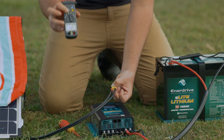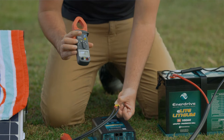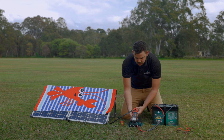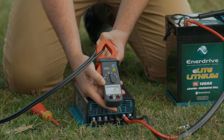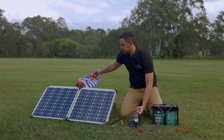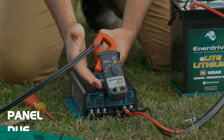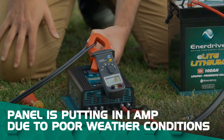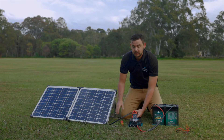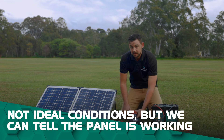What we've got here is our clamp meter. I've put it onto Amps DC and I'll zero it. Now that it's zeroed, I'll connect it through to our system. Our panel isn't producing any power — which is what we'd expect because we've got it isolated. I'll remove the blanket off the panel. At the moment we're only getting one amp, just because of the weather conditions — there's cloud cover going over these panels. It isn't the most ideal circumstance to be testing, but we can still see that our panel is working.